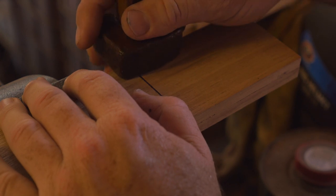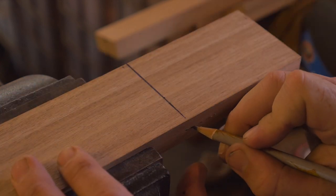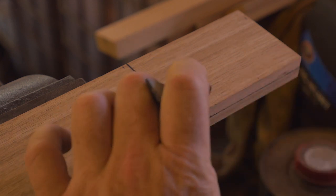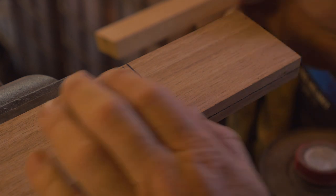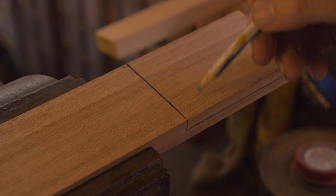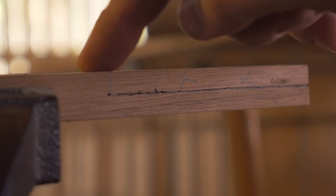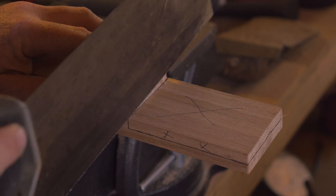We're going to use a chisel to do this. If you haven't used a chisel before, or you don't mind taking your time, you can use a saw instead. I'm going around now with a lead pencil where the marking was scraped into the piece of timber to make sure that mark goes all the way around. That gives me a guide line to make sure I'm not going too deep while chiseling. I'm going to use a scrap piece of timber as a guide to start the cut with, using a hand saw.